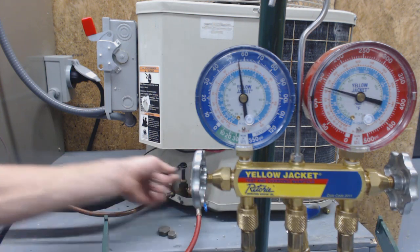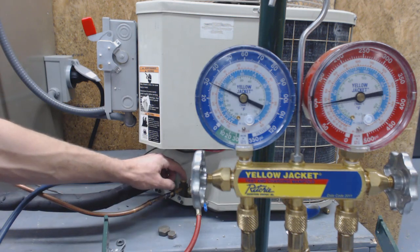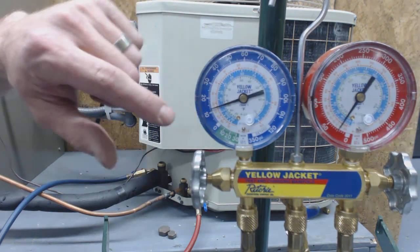I'm going to shut that down all the way, and then the compressor won't be able to pump the refrigerant out. You don't want to press too hard because there's a little split ring in there. I'm going to watch the vapor pressure start to suck down.